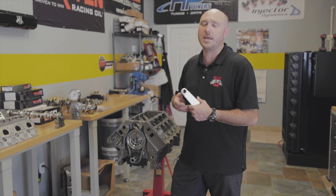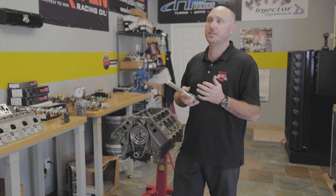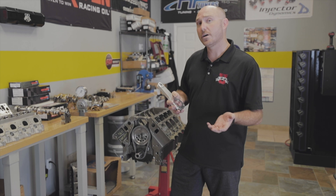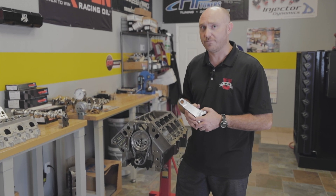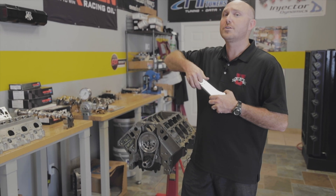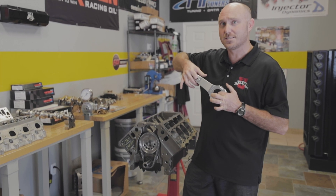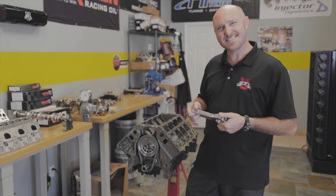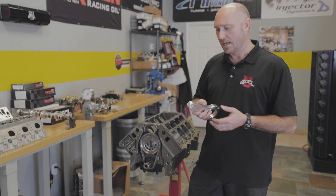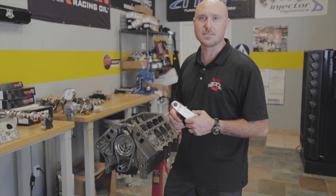I could make 400 horsepower at 5,252 RPM if I had 400 foot-pounds of torque. However, if I made 200 foot-pounds of torque but I was at 10,500 RPM, I would have half as many compressive loads, but quadruple the tensile force — because I would double the RPM, and I would quadruple the force in my tensile loads.